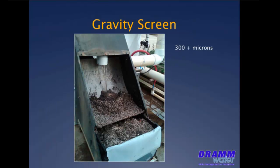The simple, lowly gravity screen filter was considered adequate for years for flood floors and still is for many applications. It's a simple, inexpensive way to remove big chunks. Filtration levels are not very fine — generally 300 microns or larger — but it doesn't take any power. Primary filtration for ground runoff and floor washdown is where I see it now, as well as flood irrigation systems that operate for short periods of time, such as a spring crop or a fall mum crop. They can get by with a filter like this.